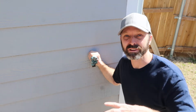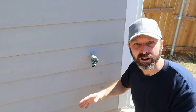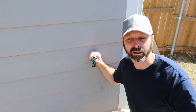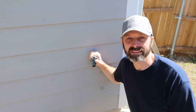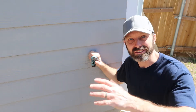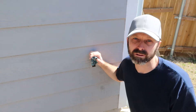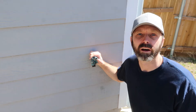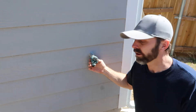You can usually find the water main in a box in the ground in front of the house — the water meter will be there. There's sometimes another shutoff in the garage; in my case it was just in front of the house. I've already released the pressure from the faucets and turned off my water heater, just in case — I don't want the elements to crack if it starts to drain.